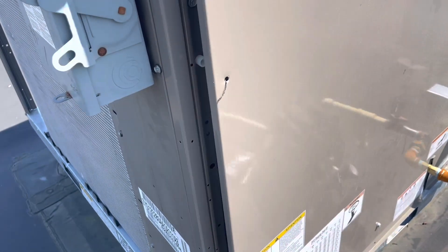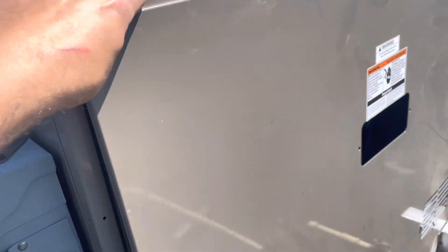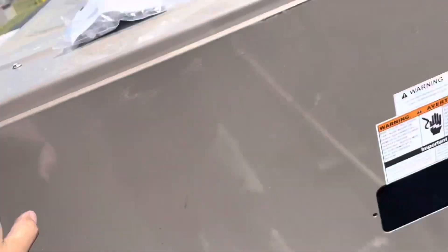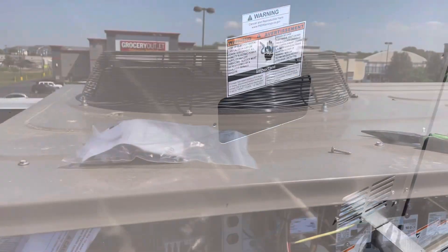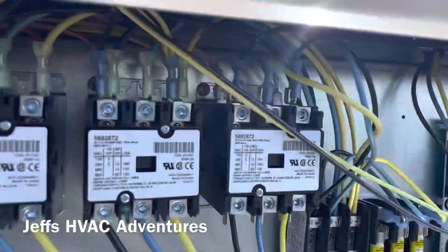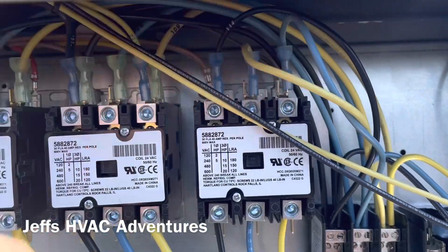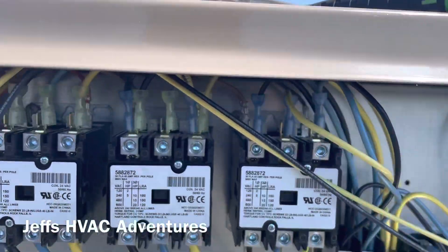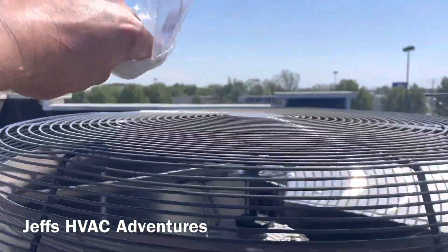It's just blowing this right off. So right from the factory, this motor was either wired wrong or we have the wrong polarity here. I switched polarity basically by just swapping my yellow and my blue wire — I swapped them around. Now we are at least turning in the right direction because I'm blowing out here now.